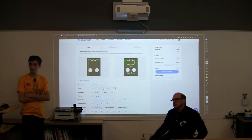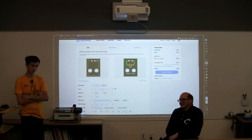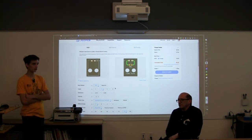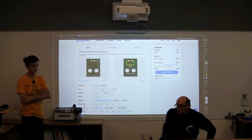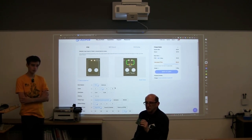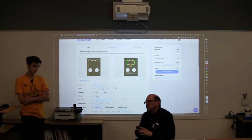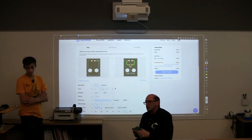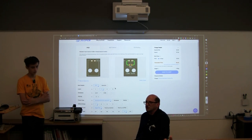What parts or mechanisms do you find yourselves often having to make a PCB for? Cameras. And just vision and localization, because that's the most customized part. The IMU. We wanted a really good IMU on our robot, and we basically couldn't buy a board for it. So we came up with our own board that interfaces to a Raspberry Pi, and we can get much better performance out of the IMU than we could with the off-the-shelf device.